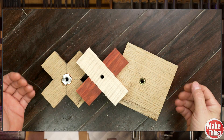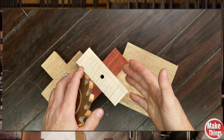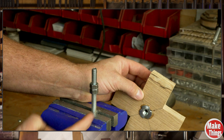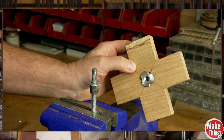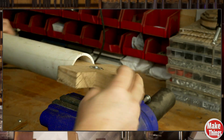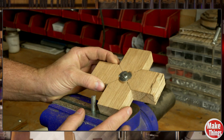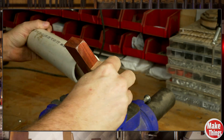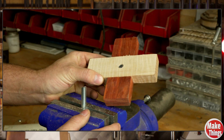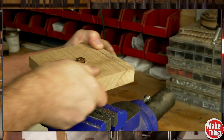Here they are — three different knob types, side by side. I've got a full breakdown on my second channel where I dive deeper into each one, including things like adding a neck or shaft to a knob and why it actually matters. Now, why not test all three? Let's throw some real force on these and see what happens. I've got a bolt in my vise with a couple of nuts jammed together and a washer on top. First up is the T-nut — I was actually a little surprised, as I was able to break the bolt. This held up far better than I thought it would. The lap joint broke the bolt off just like the other one, so I'm pretty impressed. But the threaded insert — just like I thought, with enough pressure you're just pulling it back out. Threaded inserts are great for things that don't require a lot of pressure, but they do pull out.